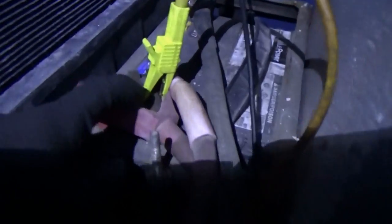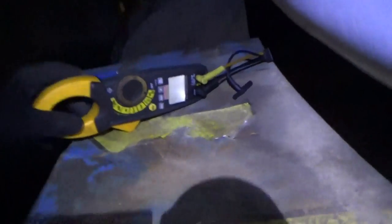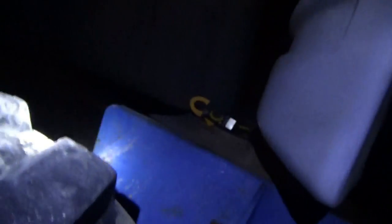I'm on the positive wire here and the negative there. Got our meter set up — the leads are kind of short but you can see the number on there hopefully. So zooming in for you guys — is it good with the backlight? 11.5 volts, right? Let's keep focused in on there. I'm going to hit the starter, see what happens. Ready?